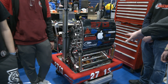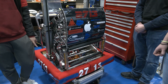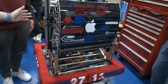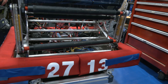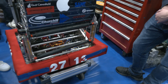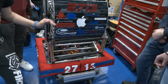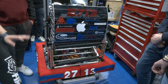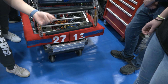So we're going to start out with the intake here. Talk to me a little about the concept, design, and thought process that's gone into it, and anything you might have changed over the build season. The first wonderful thing our robot features is our intake. This intake is run by a series of pulleys and chains with these two rollers here. Originally, the chain was on the inside of the intake and we only had chain on one side and the pulley on the other side, which caused our intake to be very floppy and not really stable. So we changed the design to having two chains here, which made our intake much stiffer. As you can see during the matches, it runs really well in collecting the balls. We also used the bumpers to guide the cargo for the intake.